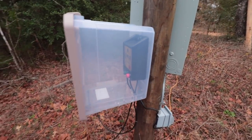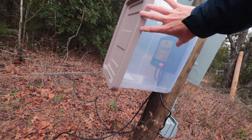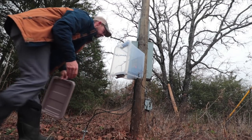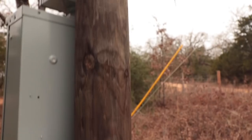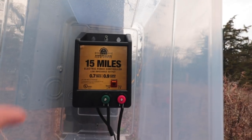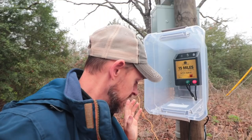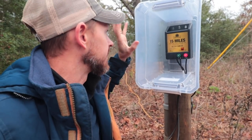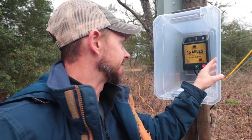This is a normal small storage bin from Walmart. I turned it on its side, drilled some screws into it to hold it onto the meter pole, and hung it up — one screw here and one at the top. Then I just hung the energizer inside. I even drilled some drain holes in case any water gets in. It was very simple. This is a great DIY answer to housing a plug-in energizer when you don't have a barn or porch nearby.